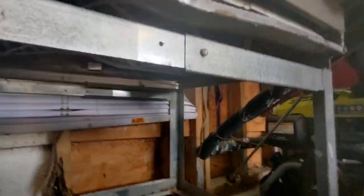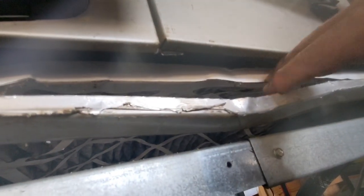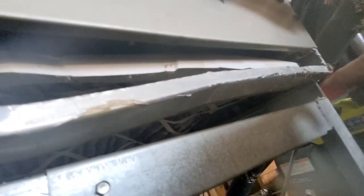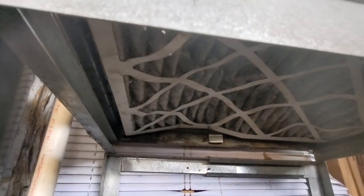Okay, I took the old ratty filter and pried down this bottom lip of the cabinet. But I think what I'm gonna do, I'm gonna seal off this gap in the air handler right here with some super sticky mastic tape, and then there's an accommodation here to slide filters in and out of these stands. I'm just going to get some 24 by 24 filters, and I believe that'll slide right in and out of there,